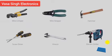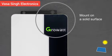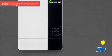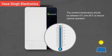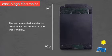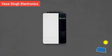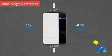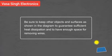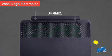Before installation, prepare the necessary tools. Do not mount the inverter on flammable construction materials; mount it on a solid surface. Install at eye level so the LCD display can be read at all times. Ambient temperature should be between 0°C and 55°C. The recommended position is vertically adhered to the wall. Allow approximately 20 cm clearance to the sides and approximately 50 cm above and below the unit for proper air circulation and heat dissipation.